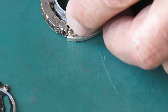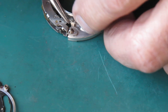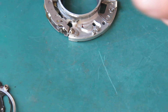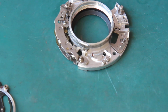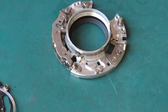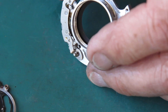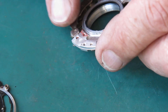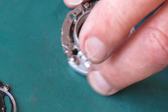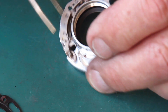Here's our speed train — the retard gear train. I'm holding back the pallets here with my finger, swinging the arm backwards and forwards. That moves quite promptly — not a bad example by any means. It will certainly benefit from cleaning. I'll flush all that out with naphtha and work it backwards and forwards. I don't take this off to clean it in the ultrasonic cleaner. I don't separate it from the mechanism plate because its position is its adjustment — and that's very fiddly.